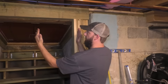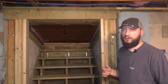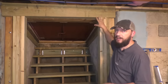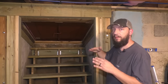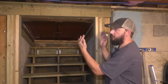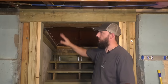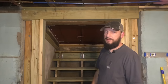I just want to keep that rectangle and then move it around however I have to in the opening. If you have a split jamb door that doesn't have a threshold, you can play — especially with a wooden door, you can make this side a little longer and cut the door on the bottom at an angle if the floor isn't level. But in this case, we're going to keep that rectangle, put it in place and adjust it accordingly. Change of plans — I'm going to get this as tight as I can. I know that with a quarter inch I'll still be able to move it around, so I'm going to make this 71 and three quarters just because I want as much height as I can possibly get. I'm going to hook on the bottom up here at 71 and three quarters, right in the middle of that hinge, which is totally fine.